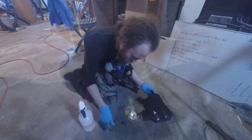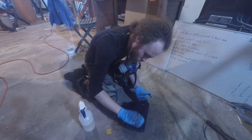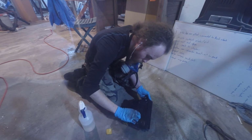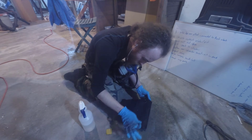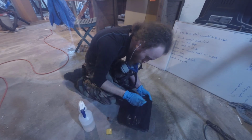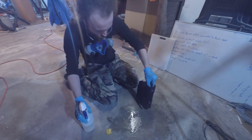At this point, I'm no longer really sanding it down anymore. That was pretty much reserved for the last round of dark primer. Using a different color of primer allows you to see exactly where your layers meet if you wear through one layer into the previous one. I don't usually, given how much sanding I've been doing between every layer, but that's typically what you use two different colors of primer for.